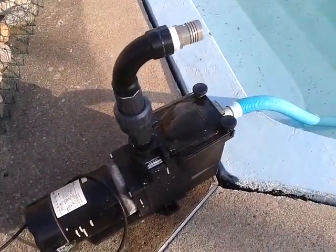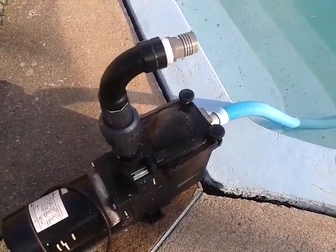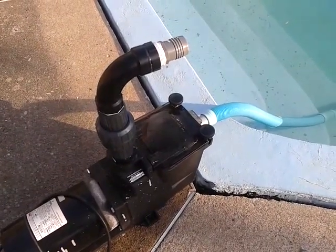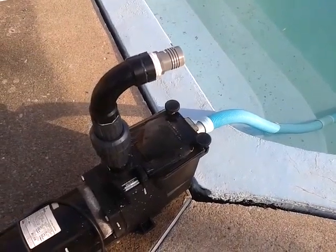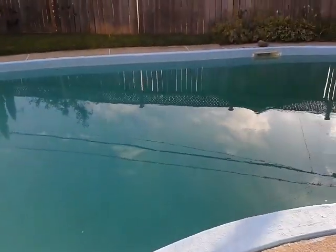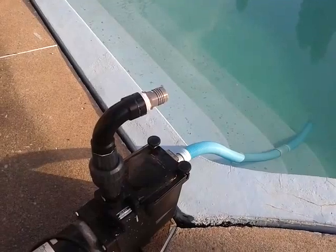Here is a simple test to see whether the motor is really capable, because I need a head of at least about 60 feet minimum, plus there is an elevation — I need to discharge the drained water to the front of the house which is at a higher elevation. From Home Depot we used to always use a submersible pump, because once the water level goes below the skimmer we can't use a regular inline pool motor.